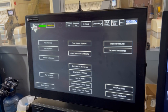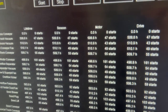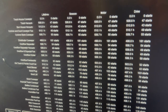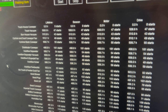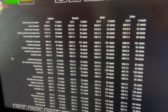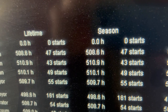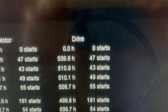Go to motor run history. You've got Lifetime, which is not resettable, but Season, Motor, and Drive are all resettable. So if you replace the motor on the warehouse conveyor, it'll reset the hours and the number of times it's been started. The ultimate goal is to do predictive motor analysis — tracking how many hours a motor has run and how many times it's been started. Tracking run hours and starts is helpful for managing routine maintenance and predictive maintenance — that is when you replace things like belts, bearings, and motors near the end of their life at a time of your choosing, rather than waiting for them to break and forcing repairs while you would rather be ginning.